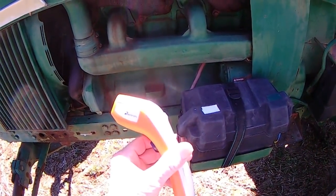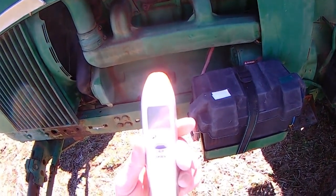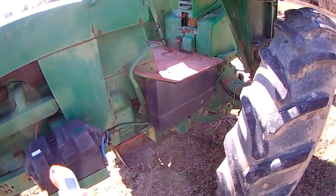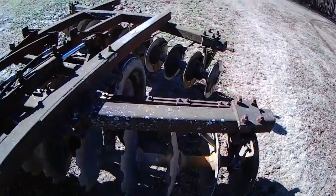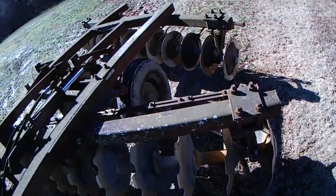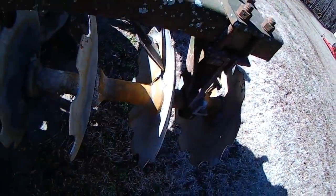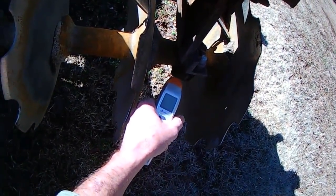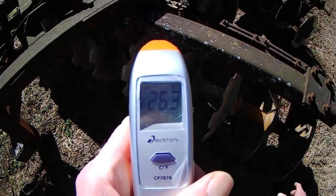These things were expensive when they first came out; they're down now to about $30. I don't recommend any particular manufacturer — I saw this one, I bought it, and it served me well. But find one and get one. Being able to check your bearings is handy. For instance, the bearings on this right here are friction bearings with no grease fitting. But if I start hearing some squeaky mess going on back here, my first suspect is whether one of these bearings is about to go — is it generating heat due to excessive friction? And if it is, I can come down here and shoot it right there; right now that's reading 26.3 degrees.